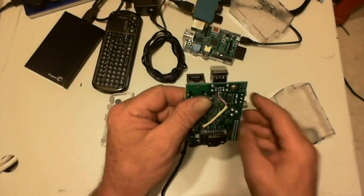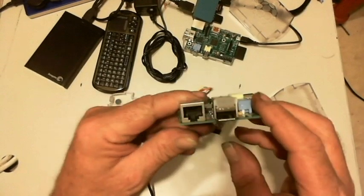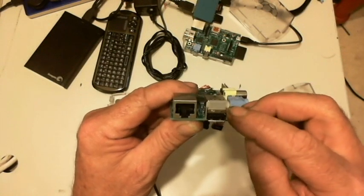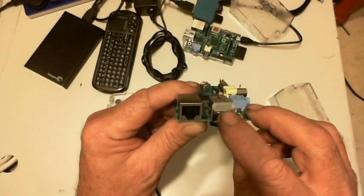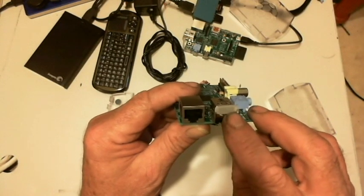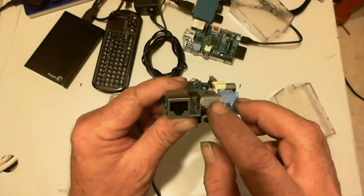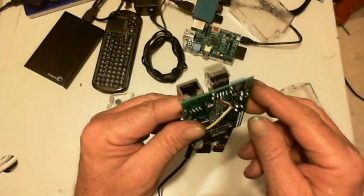Because I soldered onto the bottom row, which connects to the top port, I took a little plastic plug that comes in a lot of HDMI cables when they ship them, and carved it down slightly so it blocks that port — because I'm not sure if it'll function properly, due to the fact that it's also running to communicate to the hub. Odds are it won't.